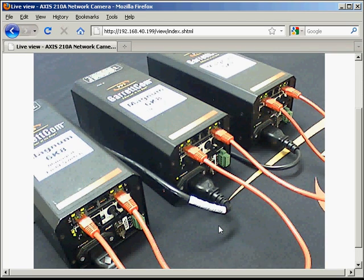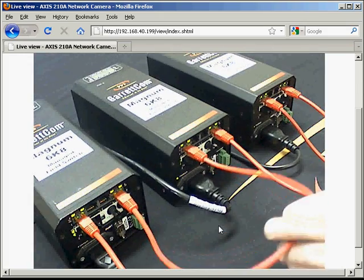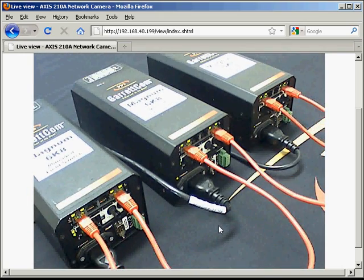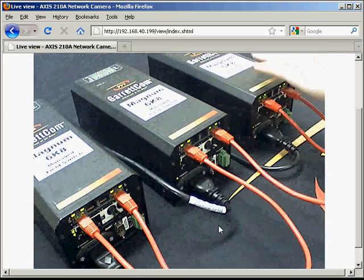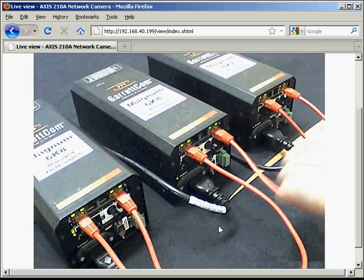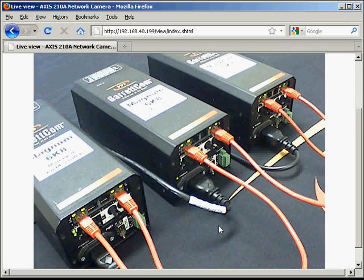While the video was paused, I went ahead and set up Spanning Tree on all three switches and also cabled the three switches together. We have switch one cabled to switch two via this cable, switch two cabled to switch three via this cable, and then a third cable linking the first switch and the last switch back together — so one, two, three and back in a ring. We've got redundant links and we're going to break the active link to see the recovery time.